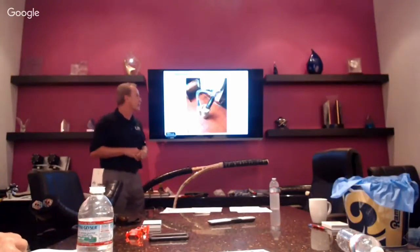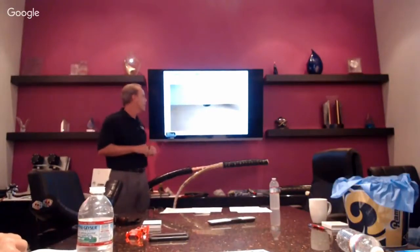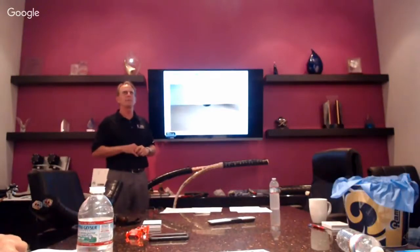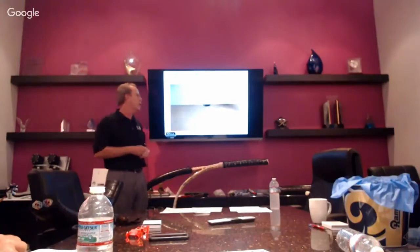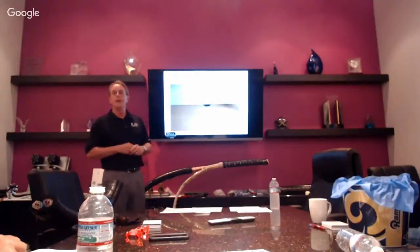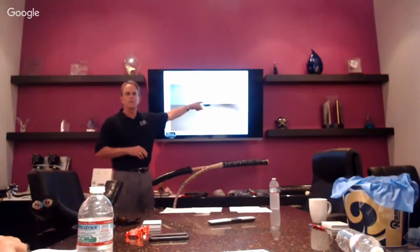My favorite's coming up, the peekaboo. There we go. So there's two things wrong with that. Number one, somebody seemed to put a wall panel on top of it. And number two, it's cut to grade level. That thing's gonna be filled with water within probably 2 weeks. Be foaming in 4 weeks. Everybody's saying, what's going on? Because that water goes down there, that water is not gonna be at the right temp, it's just gonna suck all that cold out. And I'm really sorry to say, but we were able to pull the line through that. It was like a 4-line bundle. They actually got it through. It's kind of bad because it's really gonna be flooded before long.